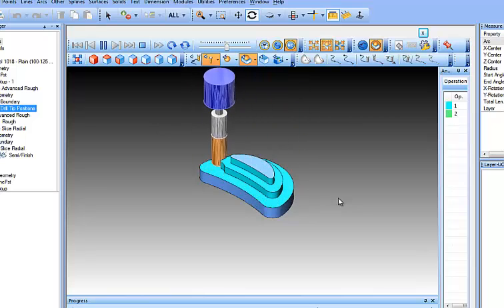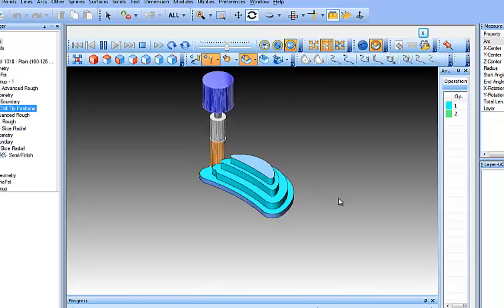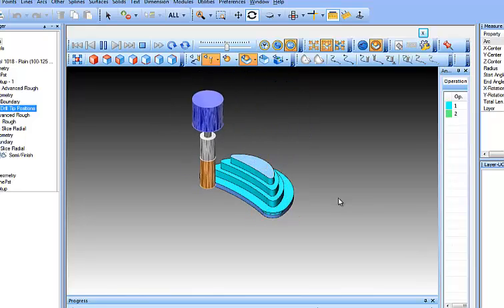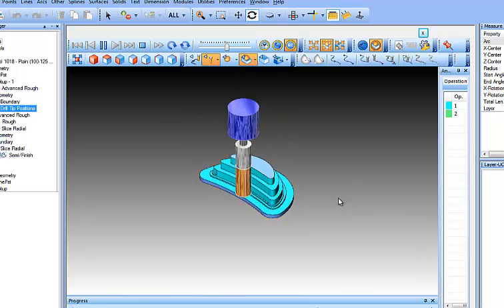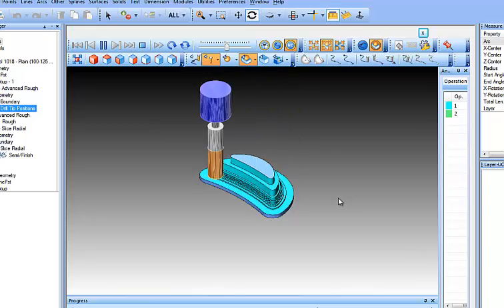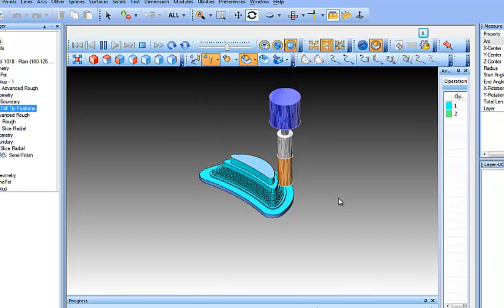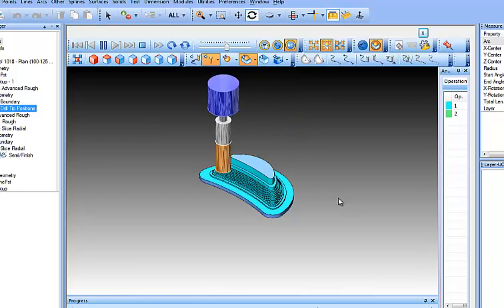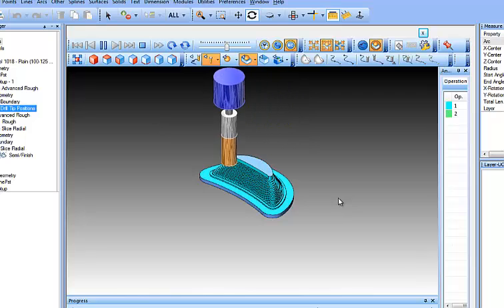I don't know if runtime is a factor for you here. It's only a single piece, and it's not worth it — a lot of our stuff is that way. So you can see how using those intermediate slices it's going back up and re-roughing it. And then from there you can come in and use your radial toolpath to finish that up.